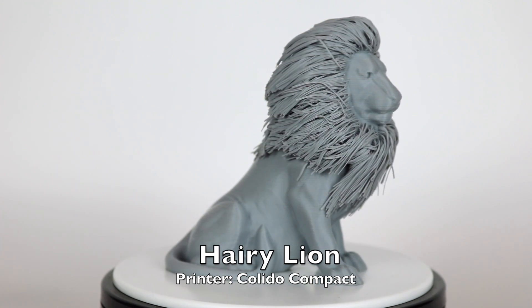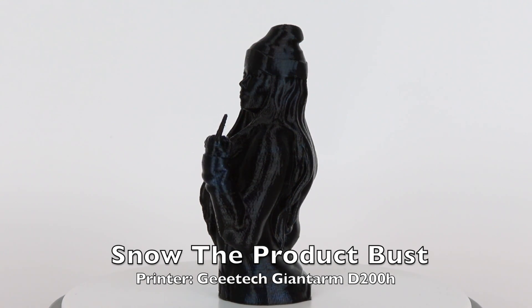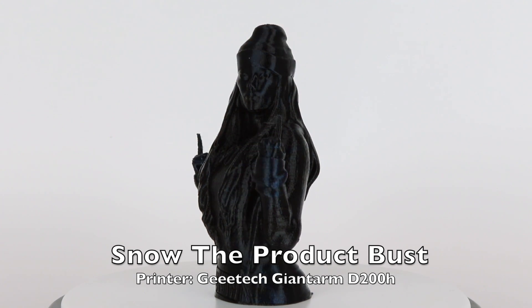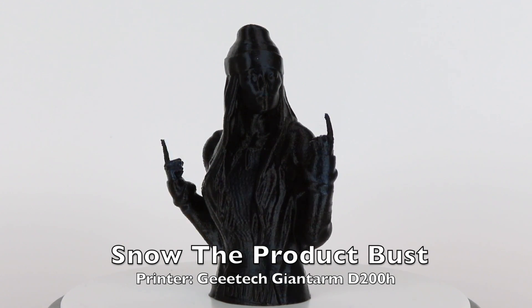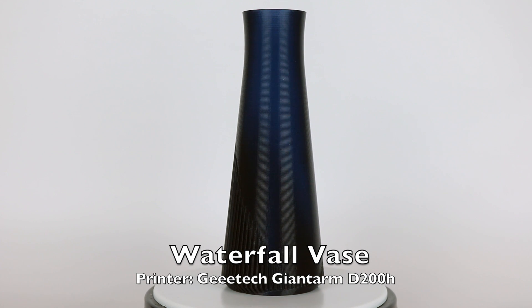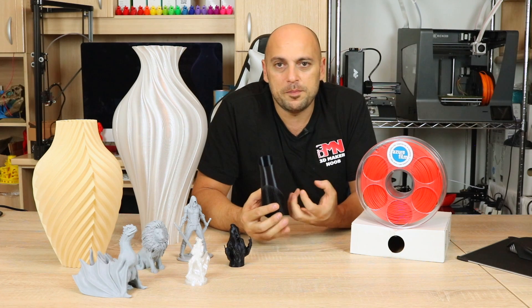It prints very well at 200 microns, but I find it prints exceptionally well at 100 microns, blending the layers extremely smoothly and making them pretty much invisible. Now while the black filament is in fact black, it takes an interesting tone of color when you print in vase mode. When you put it against the light, it's not really black — it's more like a dark navy blue color, which is actually quite nice. I can see myself doing some kind of light feature with lights coming off of it because of that deep dark navy blue color.